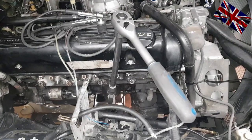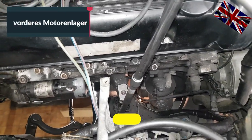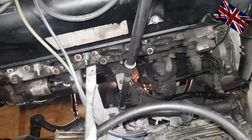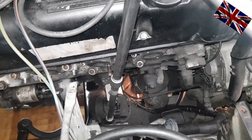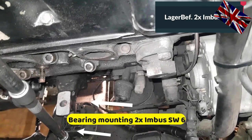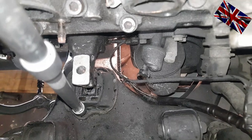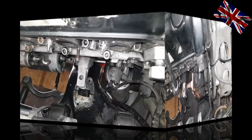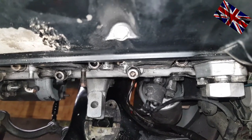Spark plug cables have been unplugged, coolant reservoir removed, fan housing unbolted. We are now loosening the bolts of the front right-hand side mount. As you see, a long extension is needed for the sockets. We start at the outer bolt, then there is another bolt at the inner side. We have just unbolted this mount. We can now remove that guide sleeve shaped like a funnel — it is Allen bolt size 6 to be used. Work your way around; it is some fiddling but you'll make it.